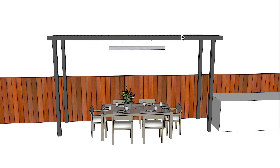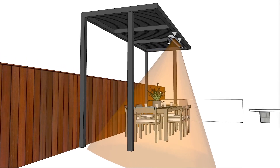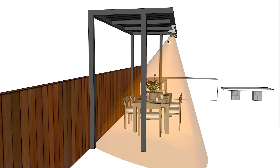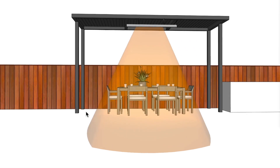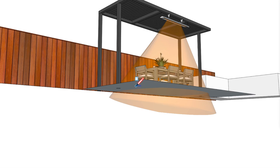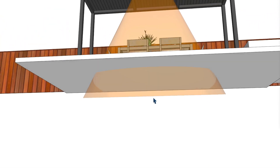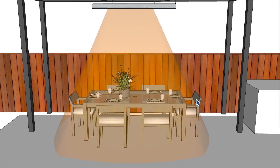It's centered within this span from left to right. Let's go ahead and look at the footprint of heat. This is designed for a slightly higher application, but I would say it's more practical for this because of the nine-foot elevation. The footprint is going to be a little bit smaller. Let me do a quick drawing — this is the slab itself. You can see that the penetration mark of the heater is a little bit narrower than at the 10-foot elevation mounting height, so we're missing a little bit of coverage on each side, especially if the chairs are pulled out.